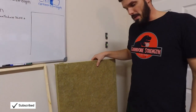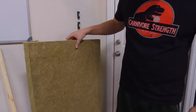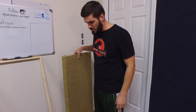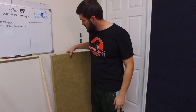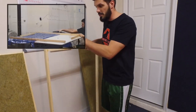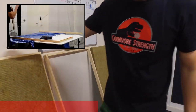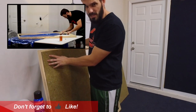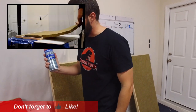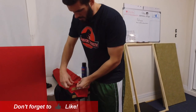We have a mineral wool insulation panel — it is 48 inches by 24 inches and 2 inches thick. This one in particular is semi-rigid; we went with this style because it's going to be hung from the ceiling and we wanted to reduce any potential sagging. Once you have the insulation panel, you're going to build a very simple frame using furring strips, wood screws, and wood glue. Then you drop the insulation panel into the frame and affix it with simple spray adhesive.